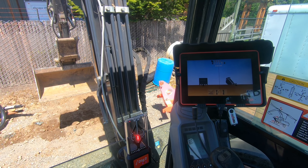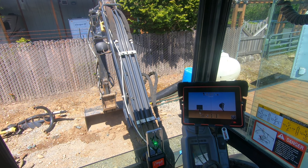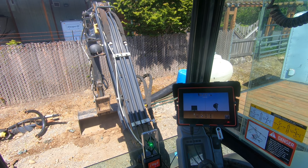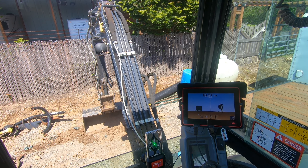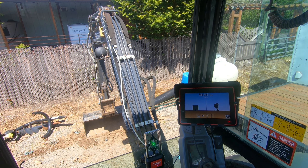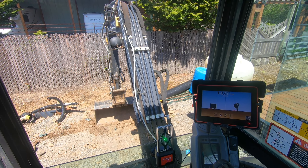Basically it's just a super useful tool to be able to measure from your cab. There you have it — the intro to the iDig CT740/741 Kinect series system. The series is upgradable from 2D to 2D Plus and 3D. 2D Plus still uses the 2D software but with two receivers — one base on site and one on the cab — so you don't need to bench, though it has more requirements. Same with 3D, which requires 3D files on a flash drive. Feel free to leave a comment if you have any questions. I'll be coming out with a manual mode installation guide — and thank you for watching.